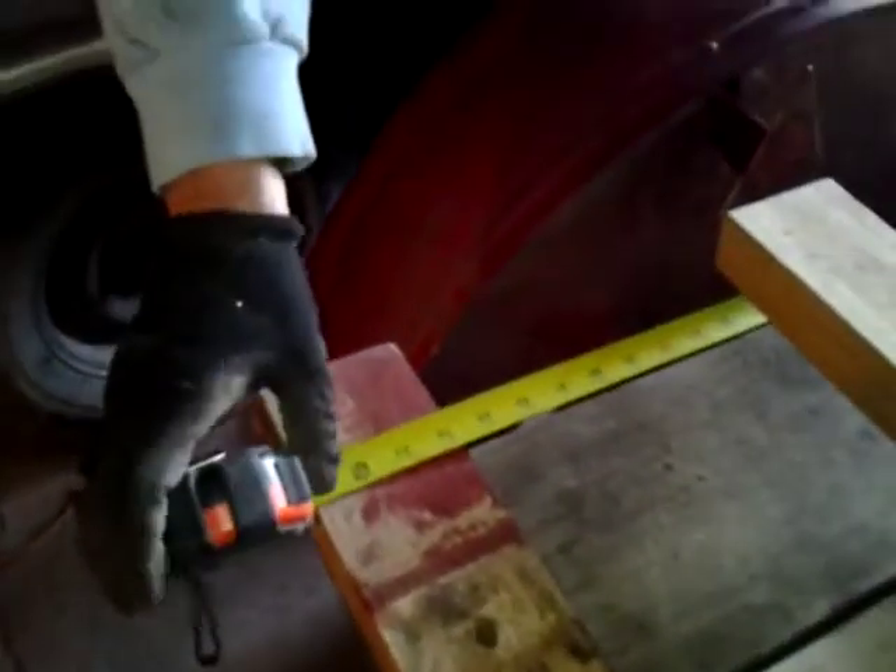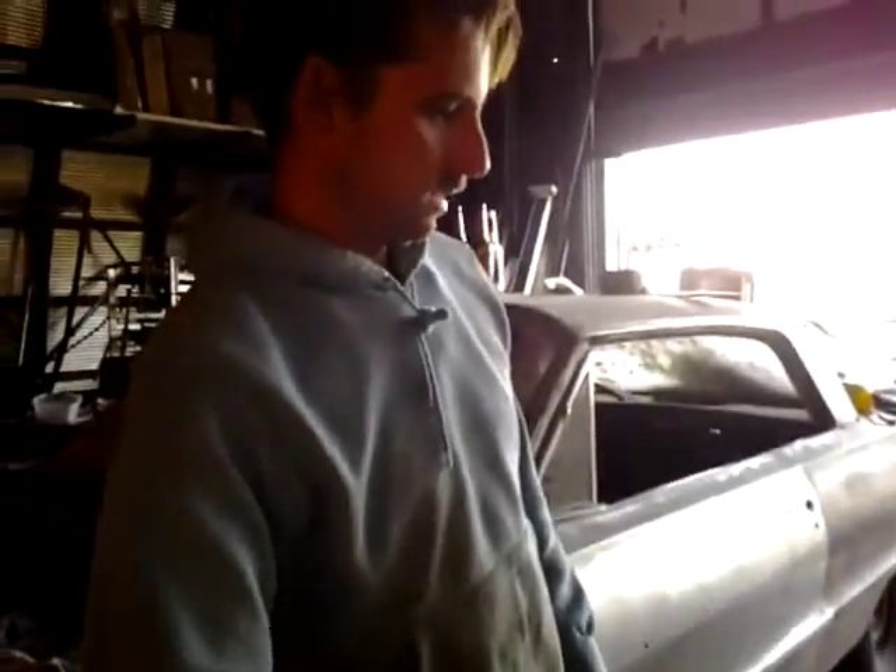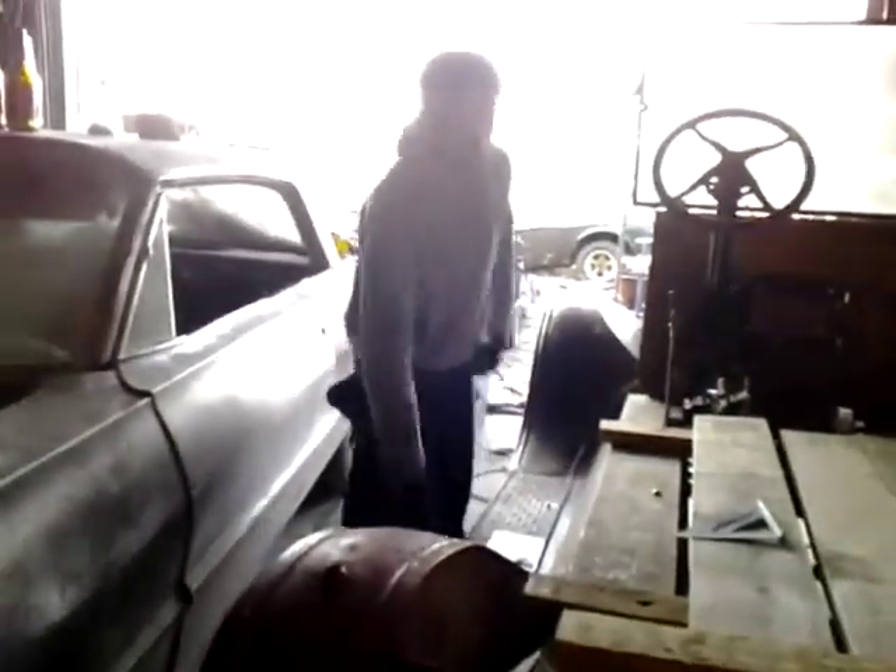I still haven't totally figured it out but it'll be pretty close to six feet — it's kind of a play-it-to-fit type of thing. I went online and used the wheel as a reference. The wheels are about 31 inches across from tire to tire, and I made a little scale from the tire to the rim, the mount, and the hub. That way when I measure, I could use the wheel as a scale, then looked at pictures online and made a little sketch. It ended up being 59 inches when measured against the wheel — that's kind of how I came up with the formula.